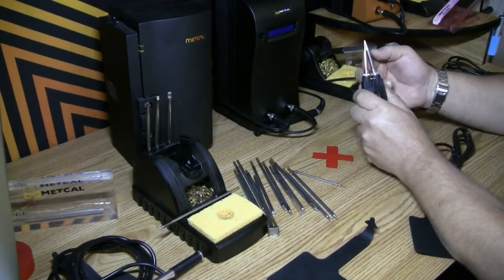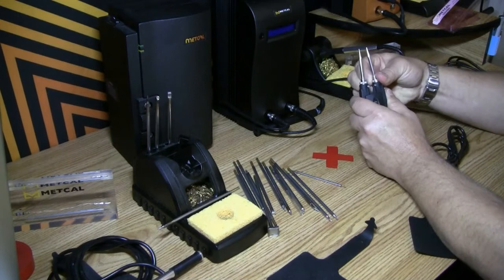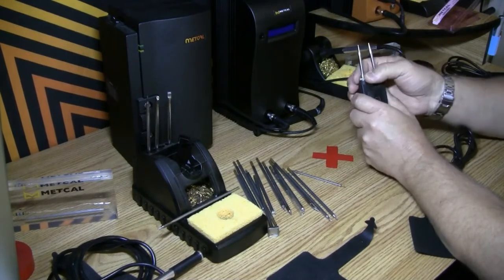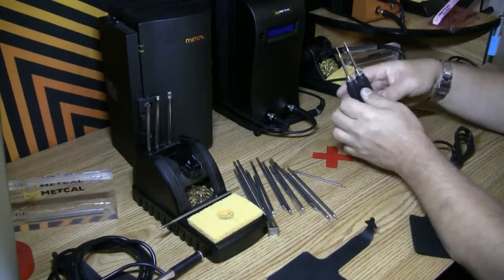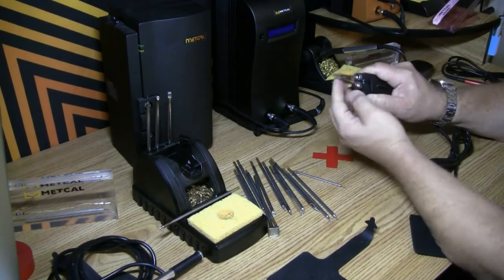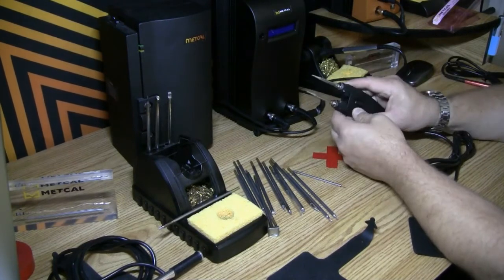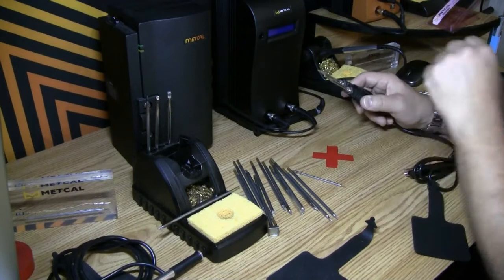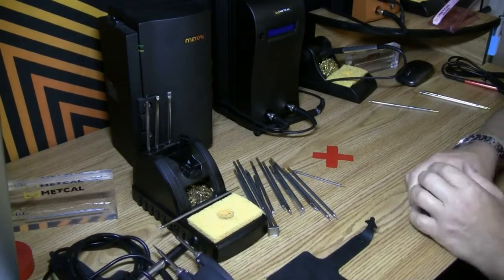On the PTZ you have two adjustable screws: the one on the right allows you to adjust the pitch of the tip — up and down — and the one on the left allows you to adjust the length of the tip, how far out it extends from the handle. By making these two adjustments, you can align your tips so that when you go to do your rework, your tips are in alignment. So if you go onto a part, especially a small part, you don't have to worry about missing the two ends. The MX-PTZ works on your MX 5200 and your MX 500 — if you had it and were using it on your 500, it goes right over to your 5200.